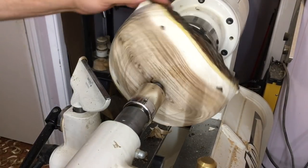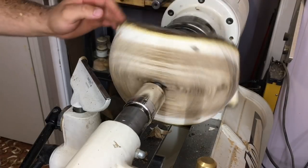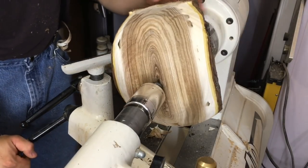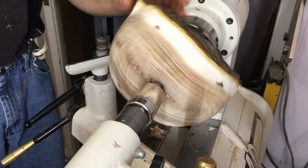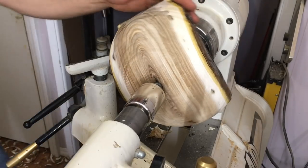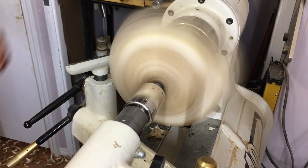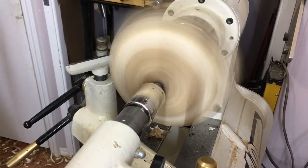I'm going to stop the lathe to see what it's looking like so far. I've still got quite a few flat spots here. What I'm going to do is switch the tool rest over to this side so I can start pushing into the bark. This wood is green and was cut recently during its growing season, so the bark isn't going to be sticking on as firmly as if it were cut in the dormant season — we need to be quite gentle if we want to try to keep it. Now we'll cut into the bark; it's a little more in balance now, so I'm going to bring it up to about 1,200 RPM.